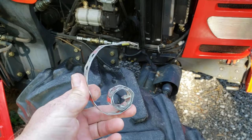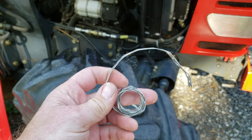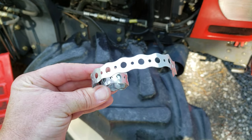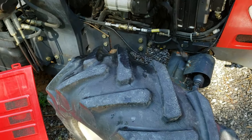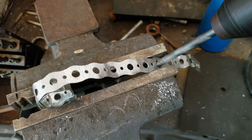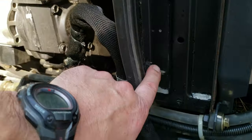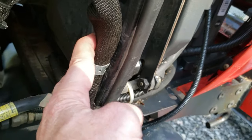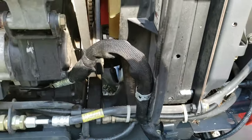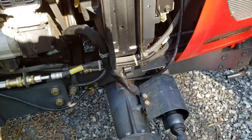Here's my idea — I'm going to make a pipe strap loop for it and hold it into place. Besides duct tape, pipe strapping is like number two to have on your farm because you can do a lot with this stuff. Not quite as much as duct tape, but this will work in a lot of binds like this one. So there's the finished product. I got it bolted into one of these fan shroud bolts. The tube can slip up and down just a little if it needs to, the hydraulic line, and now it's going to stay where I want it. The time is going to be to test these if they leak — turn it all the way to the left and right, and see how that thing does for positioning.